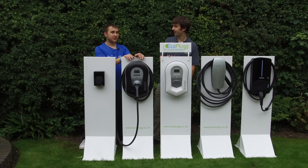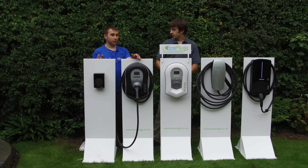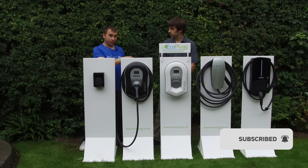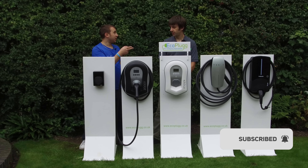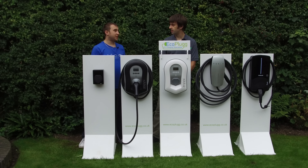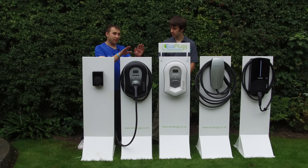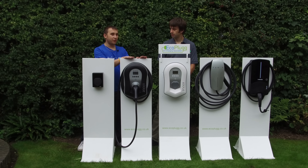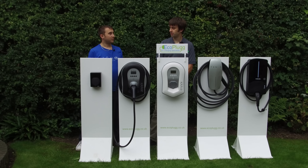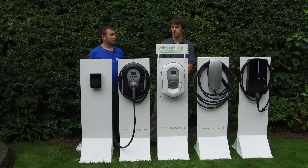Especially for Renault Zoe owners, who can be fussy about earthing, a non-earth-rod solution is arguably safer and more reliable. A physical earth rod is just a copper rod in the ground — it could rot, get kicked out, and needs periodic testing and maintenance that most people never do. The Zappi's approach eliminates that maintenance concern. The chance of the main distribution board's earth failing is extremely rare, but an earth rod is still the right and safer solution in some scenarios.